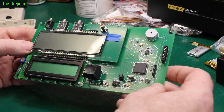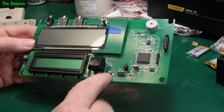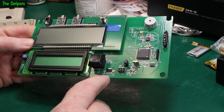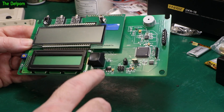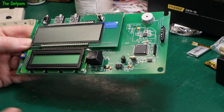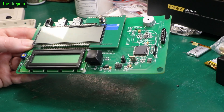So anything above 6 volts should be fine. I need to check the specs on this regulator — obviously the less voltage you put through it the better, but it means I can put anything above that. So I could probably put a 12-volt or 7.2-volt battery pack and it will run just fine. Maybe an 8.4-volt would be alright — could put some lithium cells in it. That would work.